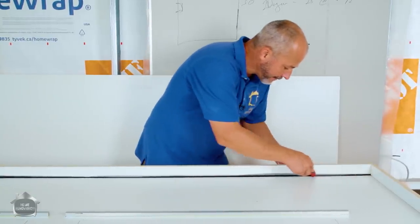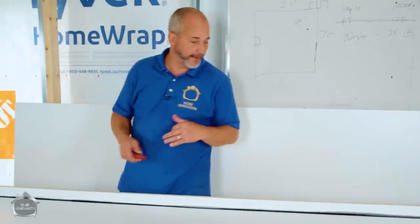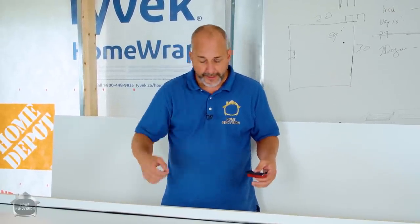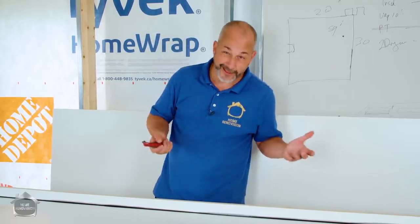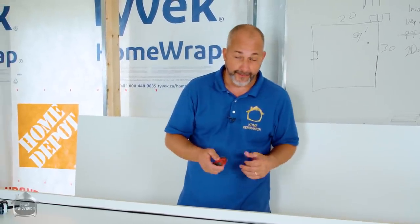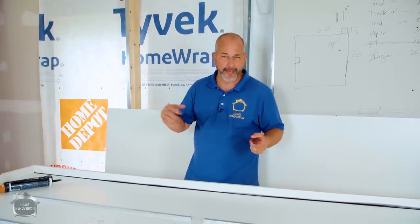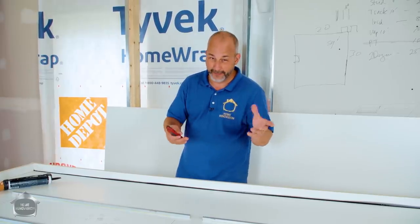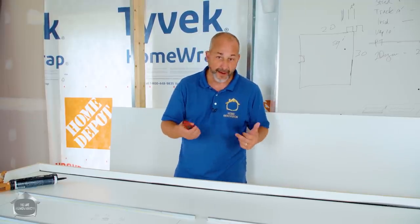Now, there are other videos on the internet. They show you, you know, use wax, use this, use the other. Scrape it all clean and then peel off the extra. And if you don't put too much on, there's nothing to really clean off. So just use a little bit of care and you'll be fine. But if you want to clean it all off after the fact, you can. This Old House does a pour, and they have the professional countertop guy. And he's showing all of his, he's using wax and that sort of stuff. Feel free to follow some of that advice if it makes you more comfortable. I'm real comfortable with the silicone, so I'm going to just go by hand.